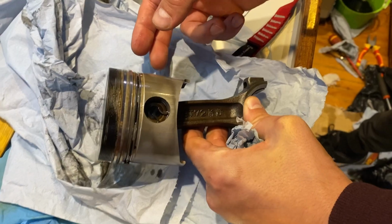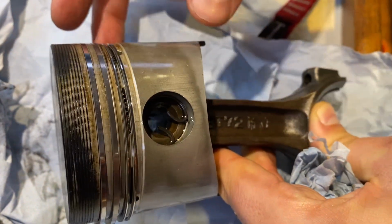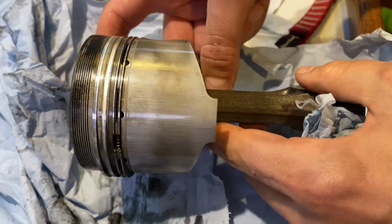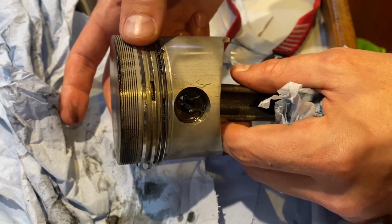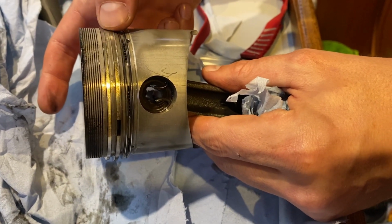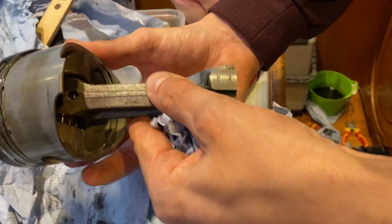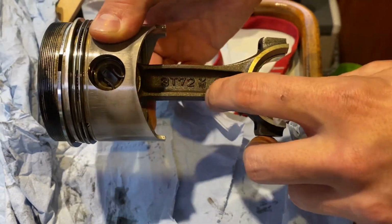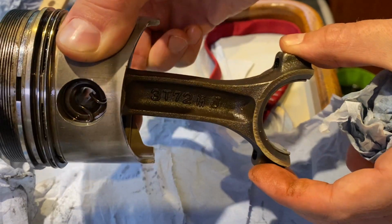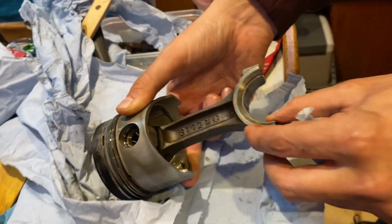So just having the piston out now and looking at everything and the condition of it, everything looks fine to us. And yeah, you've got the oil control ring here and these two are the compression rings. So you know, you could have one of these stuck or an issue, but these are all just sort of free and doing what they should be. So yeah, other than the bent rod, which is visible, whether it is on camera or not, we're not sure, but yeah, you can see it just as you catch it there. It's, yeah, it's not great. So there's one that's been ordered and it's on its way from China and it'll be here soon.